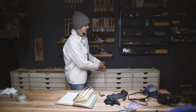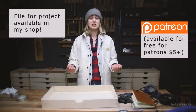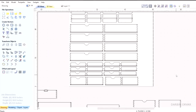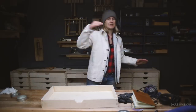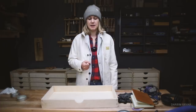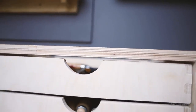The files are available for this project if you have a CNC machine and want to do something like this. I've provided the design for each piece you need to cut — sides, all pieces for one drawer — and you can cut as many as you need. I've simplified the files to assume straight walls rather than the bump-out I had to deal with. If you have a 4 by 8 sheet you'd use a little less than the 9 sheets I used. I went with Baltic birch because I really like it — the layers are crisp and it cuts really nicely.